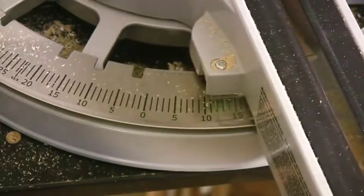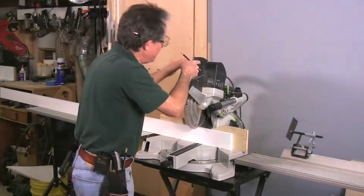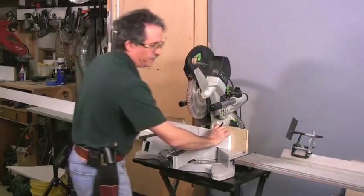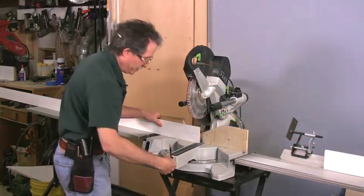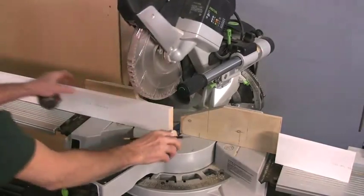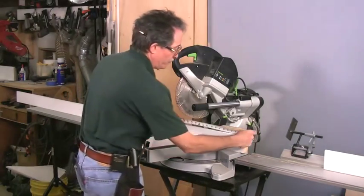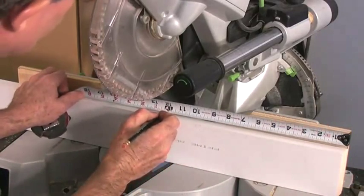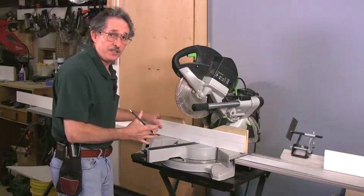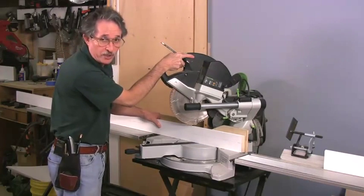I'm going to pull the saw in this direction — that first angle is 15 degrees — so I'll set my saw at 15, turn on the laser to go a bit faster, and make the first cut. For the second cut, to mate with that miter, I swing the saw to 15 degrees in the opposite direction. Now climbing up the ridge, I flush the piece up with the edge of my auxiliary fence, pull the measurement at 12 and 11 sixteenths, and that's an outside corner, so it's at 30 degrees for the top of that ridge — short point for the outside corner.